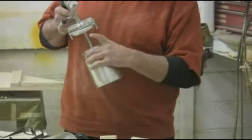The same thing applies. Now, I can also buy this directly from General Finishes. This is a tinted finish, meaning it's got color in it that's the same as this. This is more durable than this, maybe. This stuff's tough. Now, this is not the same as the milk paint you get in those bags and mix. That's not what this is. The reason I decided to go with this is because you can buy it easily. Woodcraft, Rockler, Lee Valley, everybody out there is carrying the General Finishes products, so you can pick it up pretty easy. Now, I'm going to spray it.